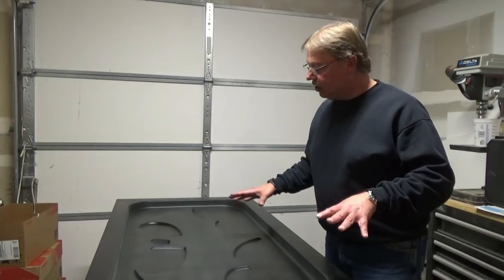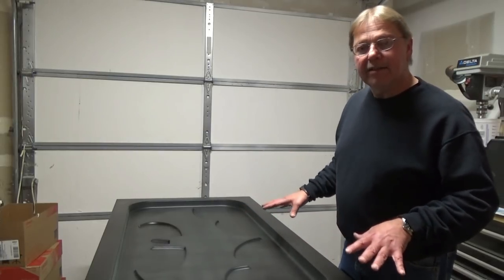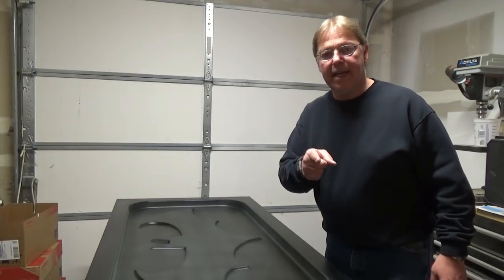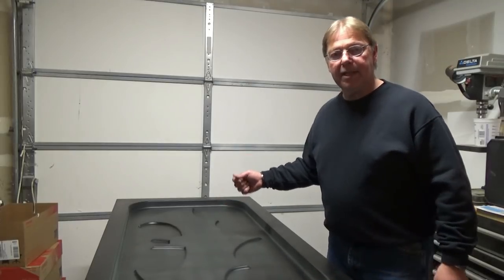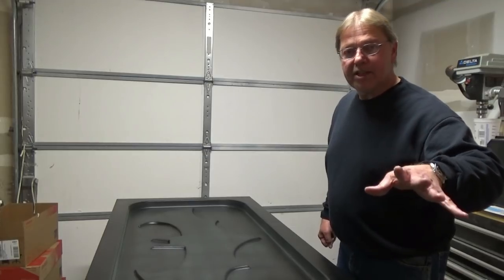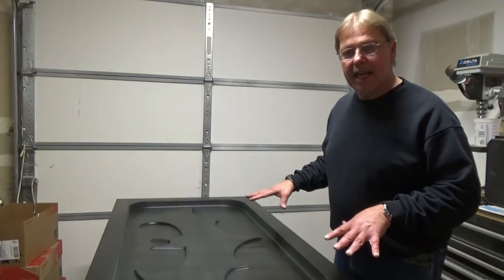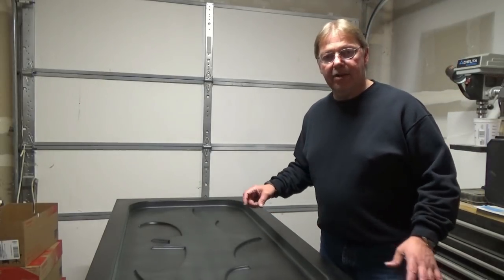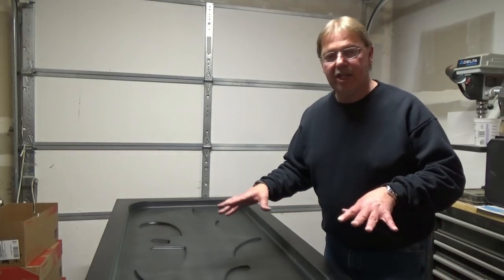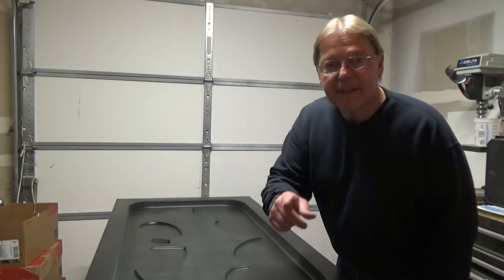The next time you see this I'll give it a good couple of wet coats, make sure it's nice and shiny, then gel coat it and we'll pick up where we left off laminating so we can get our part pulled out, trimmed, and get it on the trailer. Thanks for staying tuned and bearing with this video. I hope you learned something from my mistakes. Get it to the primer stage, wax it up real nice, start applying the PVA, and you're sure to get a good release. Please subscribe if you haven't already, like the video, and share it on some of the forums.